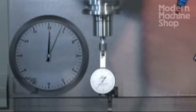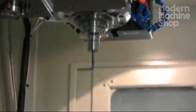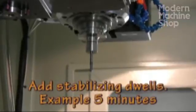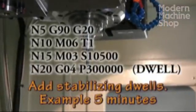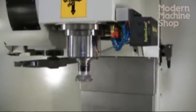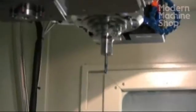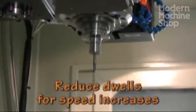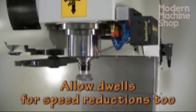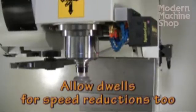Also, get familiar with the time your spindle takes to stabilize. For close tolerance applications, don't just do a tool change and start milling. Instead, program in a dwell for the time needed to stabilize. That way, you can even run unattended yet end up with accurate, predictable results. We generally start with larger cutters running at slower speeds and increase spindle speeds with subsequent smaller cutters — that helps minimize dwell times for stabilizing. Keep in mind that if an operation uses a slower speed, the spindle will shrink back. Ideally, you should allow time for the spindle to normalize for this, too.